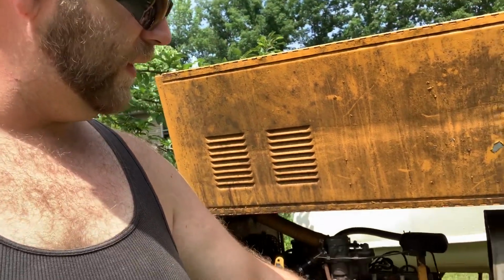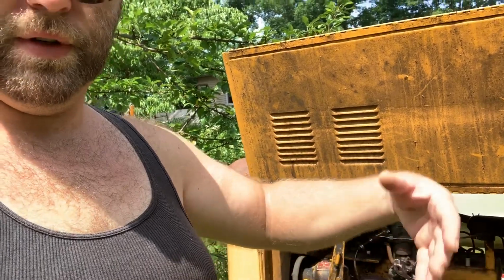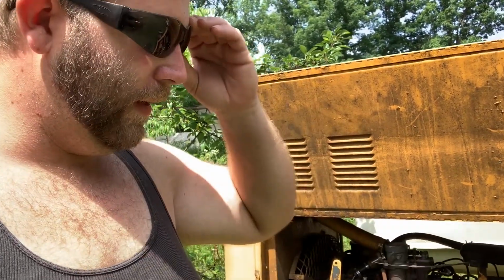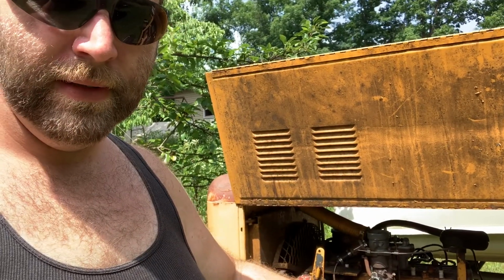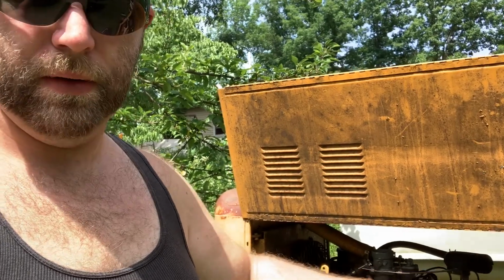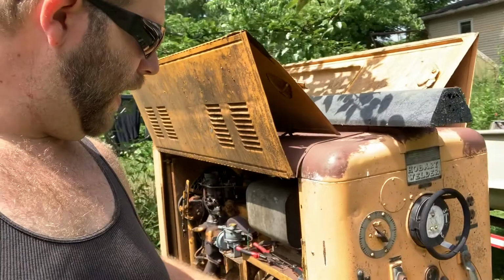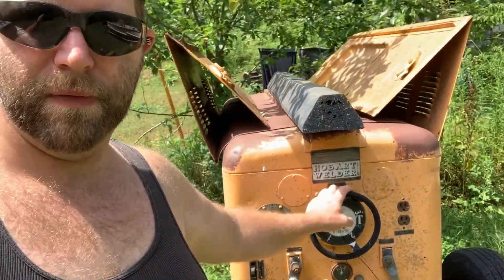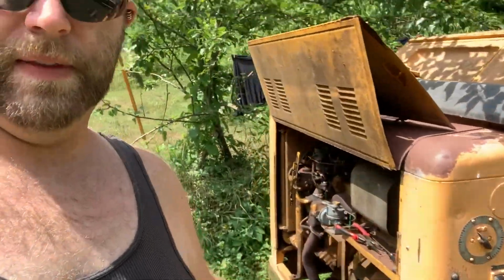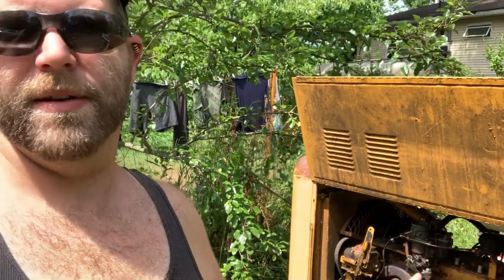It's 60% at 250 amps, which is your duty cycle. The way they do that is out of 10 minutes. That's the amount of time you can run that particular welding machine at that particular current. So if I have this thing set at 250 amps, I can run it for 6 minutes out of 10, or 60% of the 10 minutes, and then you let it cool for the remaining amount of 10 minutes. That's the standard.